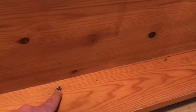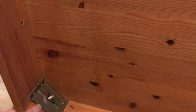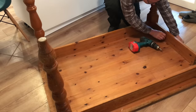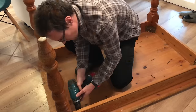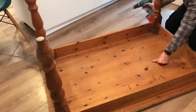The table top itself is actually held on by a number of wood screws that are put in at a diagonal to hold it down, and in the corners there are some brackets to hold the legs on. Taking the table top off is just as simple as using a power screwdriver or a drill to take these diagonal screws out. Once you've got all those out — some of them are hidden away — you can just pop the side assembly off and remove the table top.